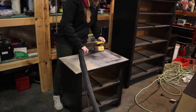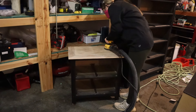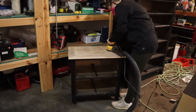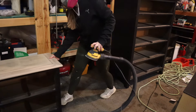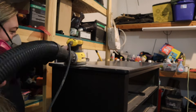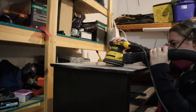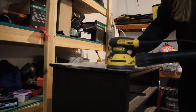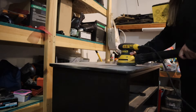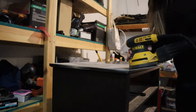When you are doing this, once you've reached the look you're going for — which for me is raw wood — then you go up in grit. I went to about 120, then around 200, and I may have used a 400 grit as well, just to really smooth out the surface. The point is your surface is going to be so scratched up and rough after the 60 grit, so going up in grits is really going to smooth the surface out once you have that raw wood back. I already know someone's going to come for me for tilting my sander like I do, but I've seen no bad thing come from it and it makes it go so much faster. Just like that, we've got some beautiful looking raw wood tops.